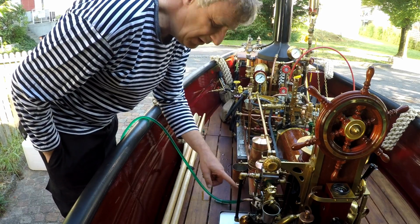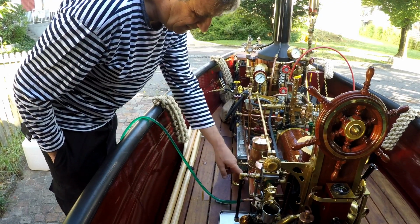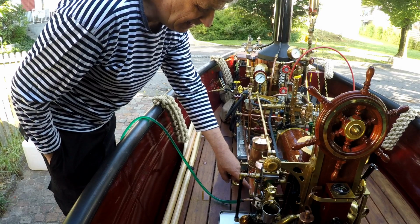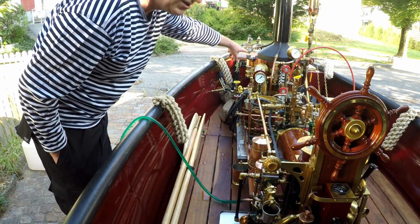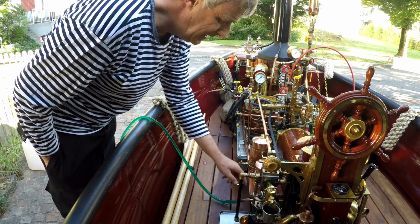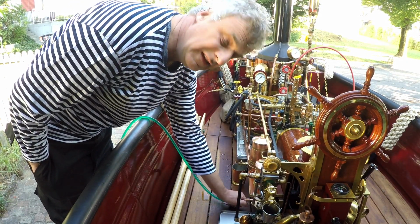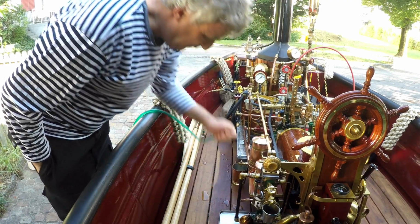It's the initial phase of the priming of the pump. If there's some air in the pump, you start the pump until water is coming out of this valve at the beginning, and then you close it. This is important to see that this pump is really underwater, and then it is capable to generate enough pressure to pump this water against the steam pressure of the boiler. As I said, I use this valve also to fill the boiler at the beginning. The boiler is full now. Take it off.